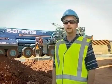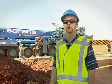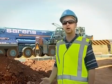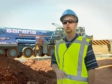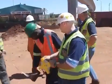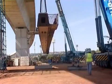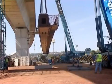When we're working out the radiuses, it's absolutely critical to put the machine at the right radius. Otherwise, if the machine is too far out or too close, your complete calculation is put out. When we work out exactly where the crane has to stand, we stand the crane as close to the load as possible while clearing the boom from the load, because you obviously don't want fouling, where the load is touching the boom, because then you could have a structural failure.